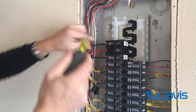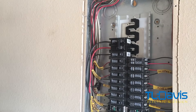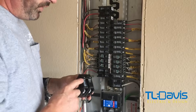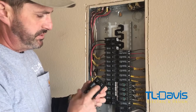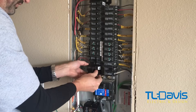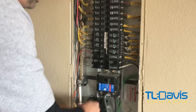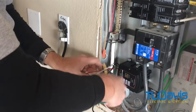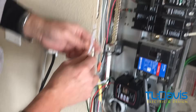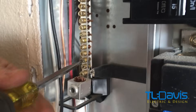Never hold onto the wire while tightening the breaker screws — that's just a safety thing. Now you can see it's been relocated. Since this unit requires a 2-pole 15, you can see it's in the middle in a trip position. We're going to snap it in — because it's in trip position, it won't have any current to it, killing all power to it. We're going to wire in the neutral and the ground first. Make sure you don't overlap your neutrals and grounds — we'll do the neutral bar here.